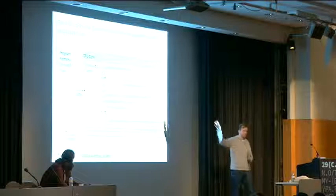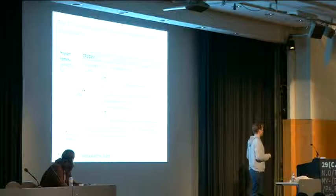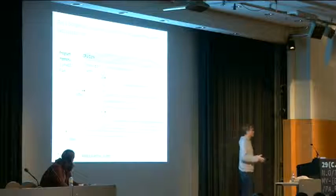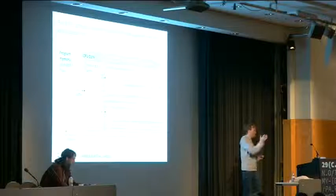Now, if we did put a needle on one of these bits, what would we actually see? We'd boot up the chip, and we would see it go through some kind of self-test routine. It would maybe write things to memory, read them back, check that the memories are working. It would set up some internal peripherals. It may set up memory maps, the MMU, and so forth. And then it would start executing the actual program. And it could be as simple as going through an infinite loop until somebody provides the right PIN number, and only then executing the actual program.